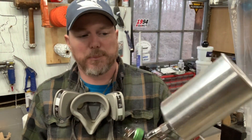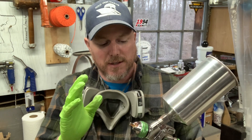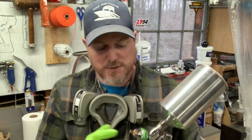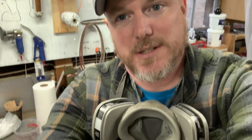This is an HVLP spray gun, just like you've seen people paint cars with. Most of these will not work for gel coat, and the reason is because the nozzle isn't large enough. This is a 2.5 nozzle, and that is more than enough to allow the gel coat to come through. If you do one thing when you buy this — and I'm going to put a link down below — it's going to come with one of these little filters inside. You have to take this out. If you don't take this out, the gel coat is not going to penetrate through that little filter and come out the nozzle. You have to take this out. This is very important — you've got to pay attention to this stuff.